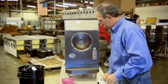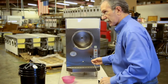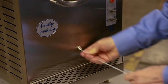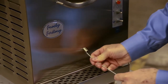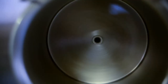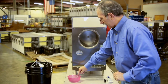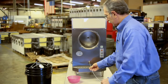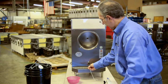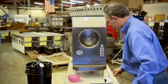While we've got it apart, we're going to need a paper towel to clean our ceramic ring. We're also going to dip our drip tube brush in hot water and run it up into the barrel. The brush comes up in the back of the barrel behind the ceramic ring, cleaning out any debris or residue in the tube. We want to do this until the brush comes back clean — that's a very important step to cleaning the internals of the unit.